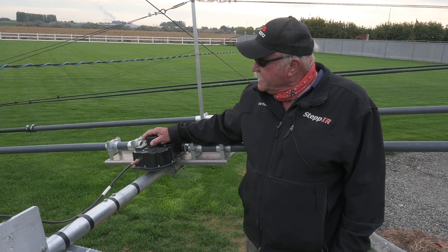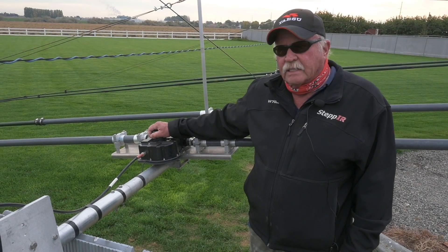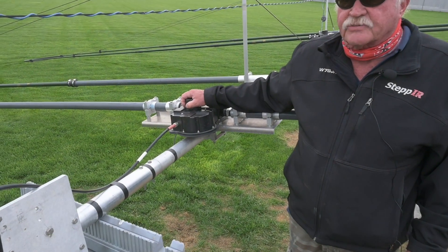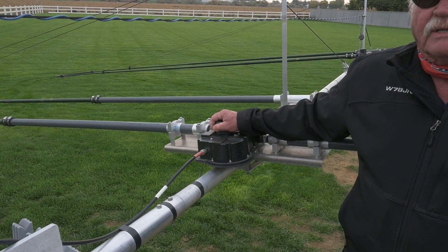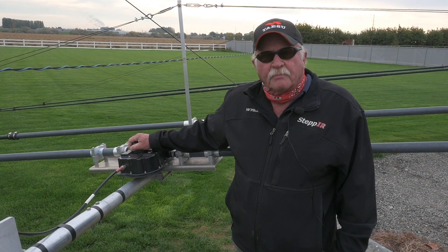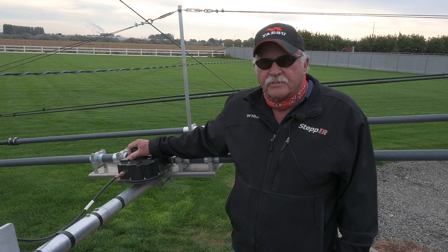This is the 50-foot-long high-performance driving element that really integrates the whole antenna and makes it happen. This antenna is extremely high-performance — it will rival any monobander on 40, and not too bad on 80 either. 1.8 dB gain on 80, and it covers all the bands through 6 meters.